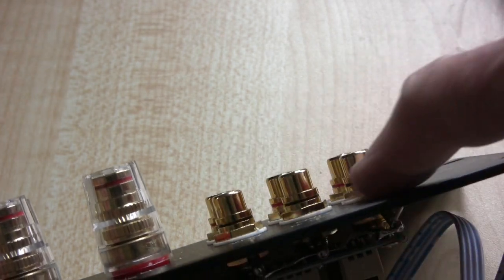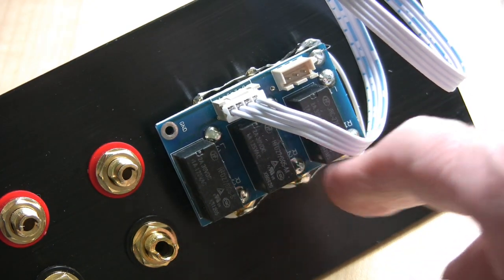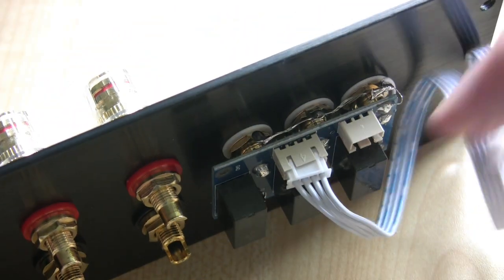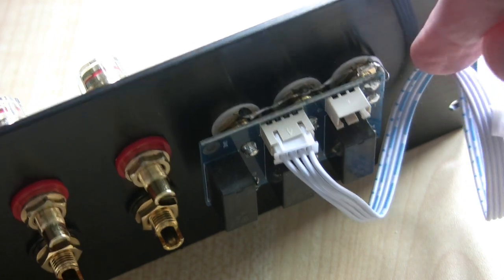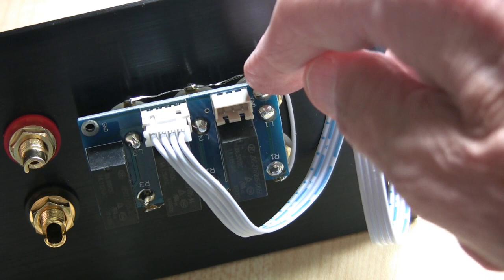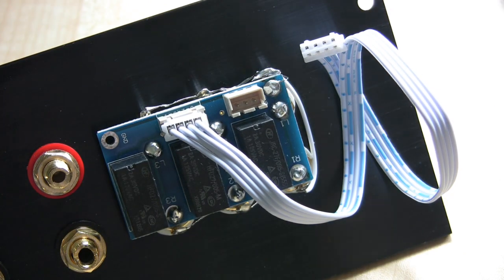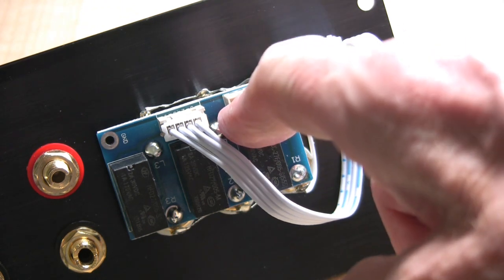What I've done is screwed these to the front panel, and then the module pushes onto the back. You solder the positives and you have terminals on here — that's all ground. I've earthed them all to each other, and here on the board is the board ground. So you just take a link from there and it will earth it and go via this cable to the front panel. If you look at the photographs supplied on the internet with this cabinet, it shows this mounted upside down.